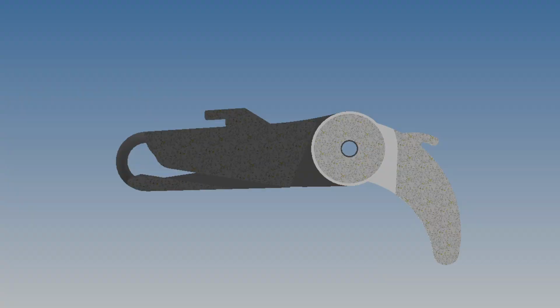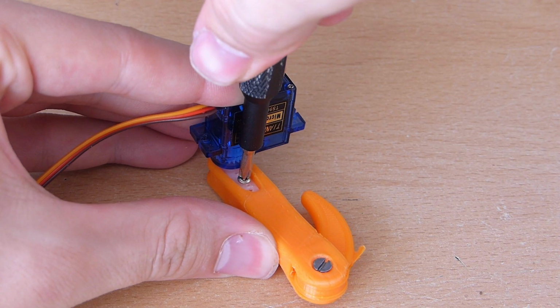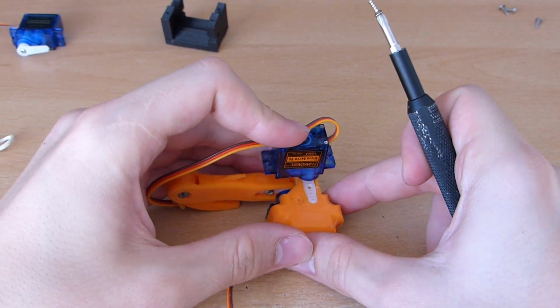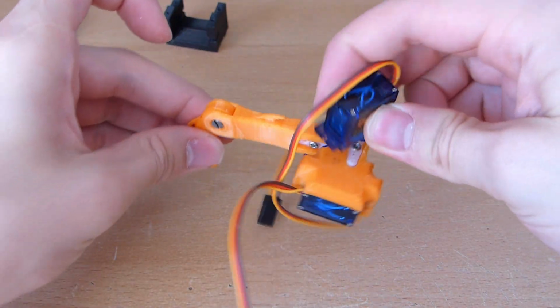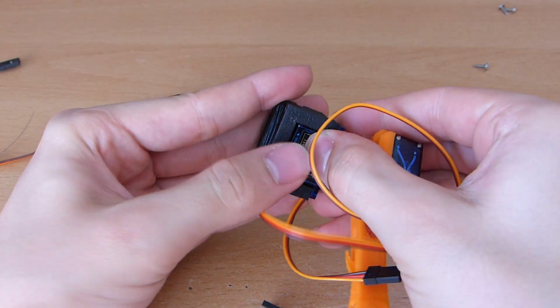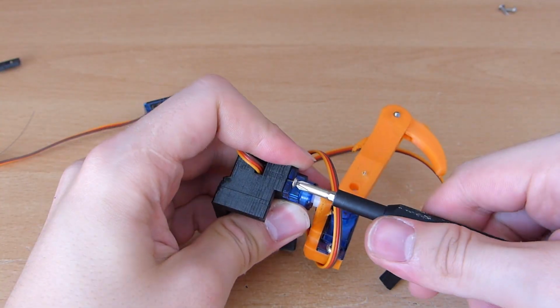So I decided to control the joint with a small string which can be pulled to raise or lower the leg. Then I added the vertical hip joint, which is just a servo. And after adding a small mounting bracket, I could screw on the horizontal hip joint, which is a servo too. As you can see, every joint works as it should, with the only exception that the knee joint isn't powered yet. This part is just a mounting piece. It won't be needed later, since the servos will just be screwed onto the main body of the robot.